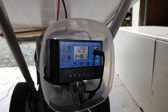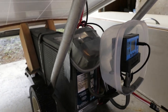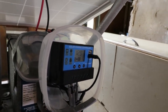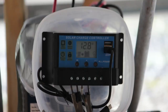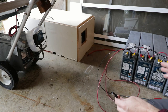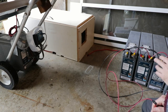The solar stroller is currently sitting at 12.8 to 12.9 volts — you can see it — and producing 0.2 amps, which is basically nothing. You can also see I've added this bit of Tupperware around it just to cover the terminals and give it a little more rain-proofing. I have a cover for this piece here that I can put on if I want to, though it's not working terribly well — I think I'm going to rethink that. The solar stroller is at 12.8 volts and the battery bank is at around 12.4 volts. So when I connect the two, we're going to see the solar stroller immediately drop as excess energy starts to discharge into the battery bank. So I'm using the single battery on the solar stroller to charge the bank of nine batteries on the floor.